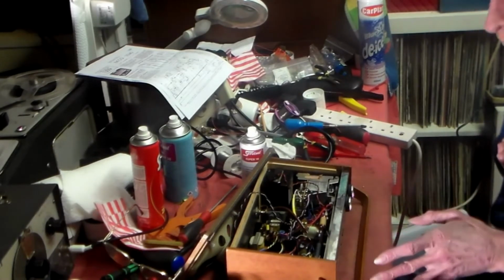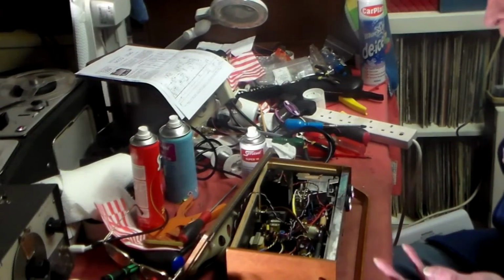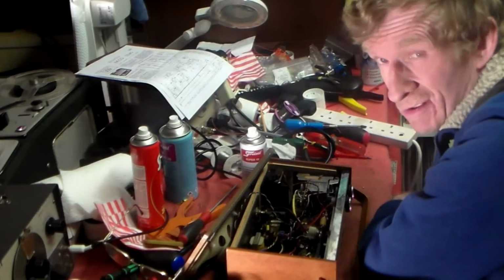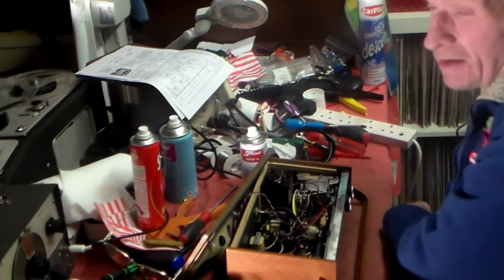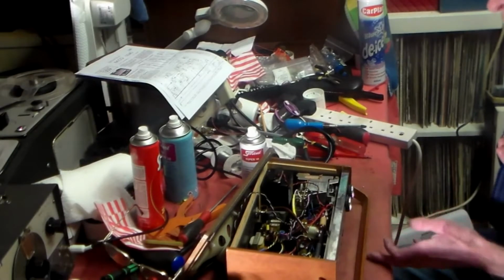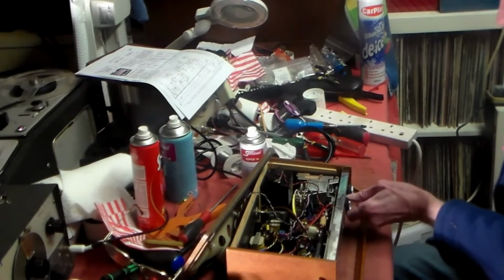And I mentioned that because one of the problems they have with that TV set, even to this day, those of us who own them like I do, is the fact that they have black capacitors in them that look about like black licorice allsorts. Collins caps. They're made in Ireland and they are not good capacitors at all. And this radio has got some in. So that could be the problem.